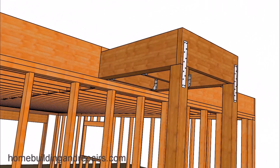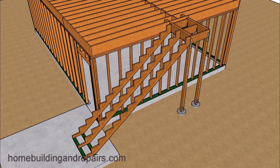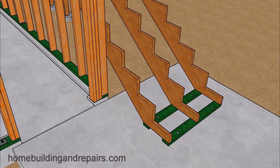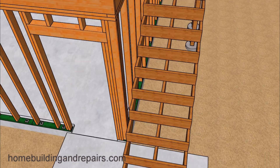Let's go to the front here and get a good view, including the footings for the post and the stair stringers. The stairway is coming past the edge of the building — something an architect might not like to see. However, if you don't have a choice because the top of the stairway needs to be at a specific spot, you work with what you have. I do have a space between the stairs and the wall for exterior finish like siding or stucco, which could save us a few dollars in waterproofing where the stairway connects to the building.